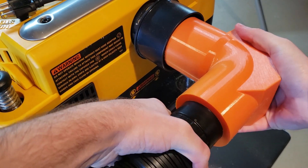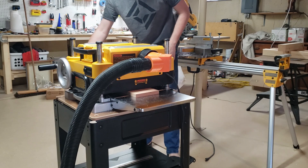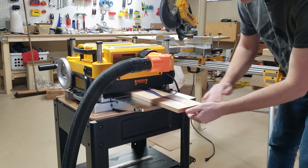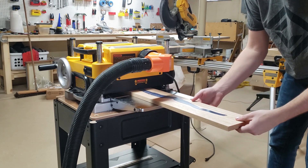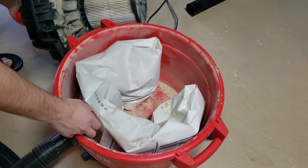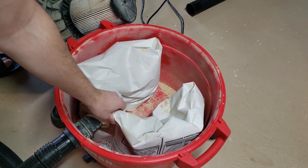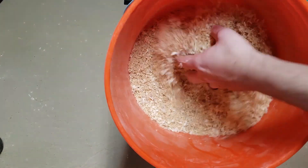There are a few things I should mention first. This planer has an active blower system, so it's going to be forcing air into your shop vac. It's actually quite nice — you don't even need to turn on the shop vac in order to run this; it's basically just acting as a big filtered collector. That said, it's probably blowing more air into your vacuum than your vacuum typically pulls, so just be warned there may be some complications, especially if you have a bag in your shop vac. Also, this can fill even a large shop vac up pretty quickly.